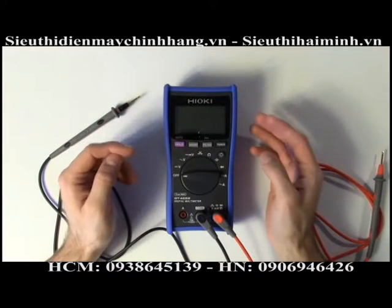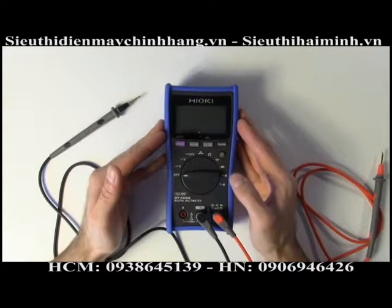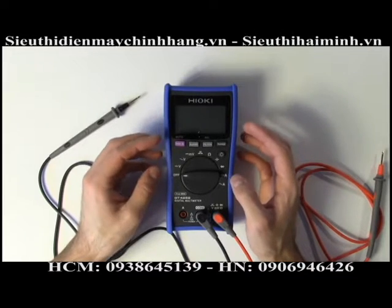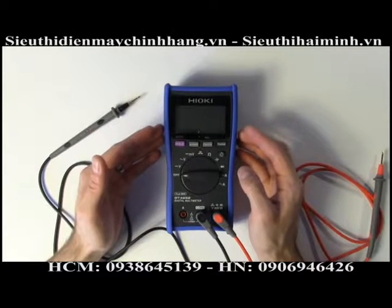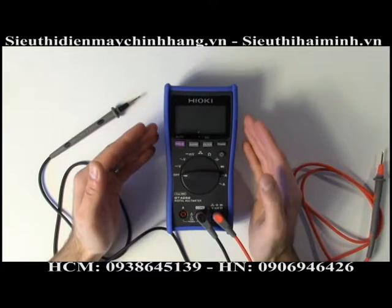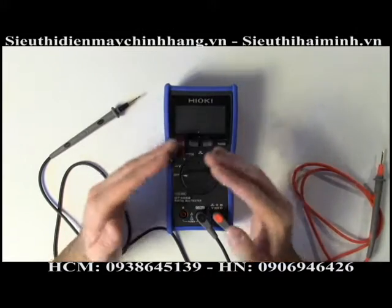Where this meter may fall a little flat for electronics engineers is in its current measuring capabilities. This is their middle range — they consider this general purpose. It's only got two ranges of six and ten amps. It will measure down to milliamps, but you won't get very high resolution out of it. If you want higher resolution in those low current ranges, Hioki does have the next step up in this family, which is the DT4253. It costs about $180 to $190, and it does have a proper microamp and milliamp range on it. However, it won't go into the full amps. So if you need a meter that can do everything from microamps up to 10 amps, you need to step up to Hioki's high-end meter range or look elsewhere, because they don't have anything in this middle tier that will do that far of a span.